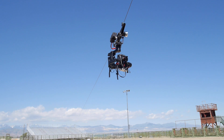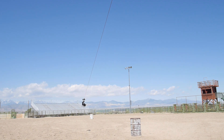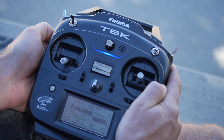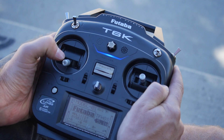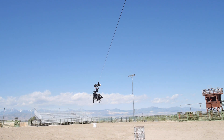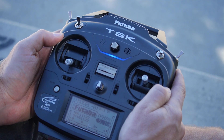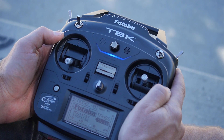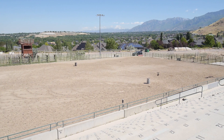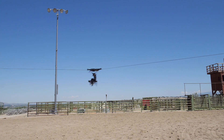To set the end points, drive the trolley away from you — give yourself plenty of distance — and come to a stop. Then you're going to change direction by flipping the switch. You'll hear a triple beep, and that's telling you that the end point has been set. Now you'll throttle back to come back to you. Throttle speed is limited during end point setting. Change direction to set your second end point. You'll no longer hear the trolley beep as both end points are set, and it will automatically come to a stop at your end point. To demonstrate, I'm going to go full throttle and it stops all by itself.